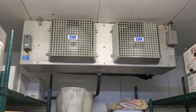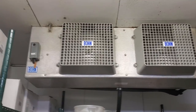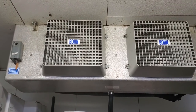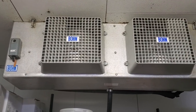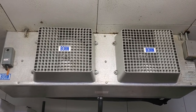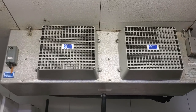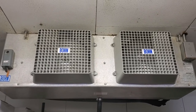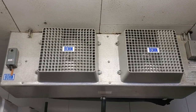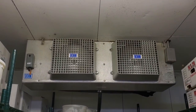We have an older walk-in cooler that is not working correctly. The manager keeps stating that the breaker is tripping, but he reset the breaker and it's been running since. He says that the breaker has tripped two times and the breaker that tripped is the three-phase breaker. Normally on a walk-in cooler, the three-phase breaker is just for the condensing units, but he says that when the breaker trips, the fans shut off.